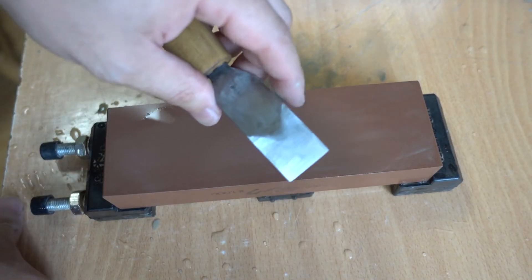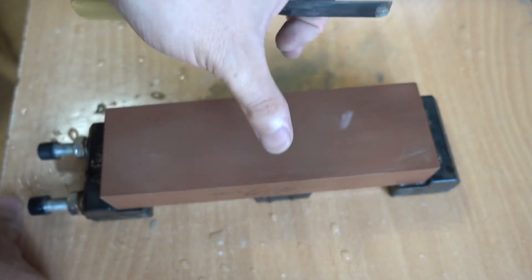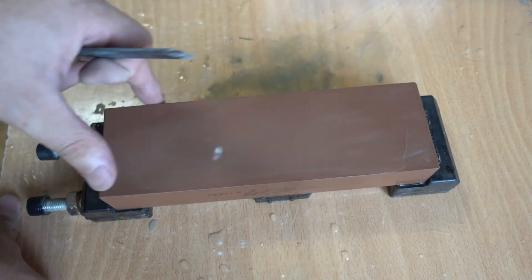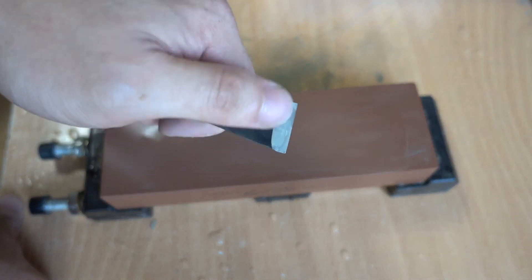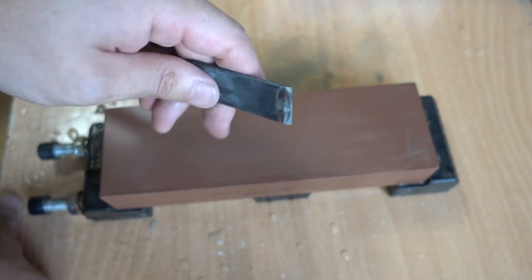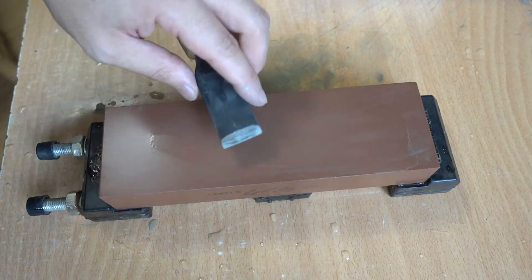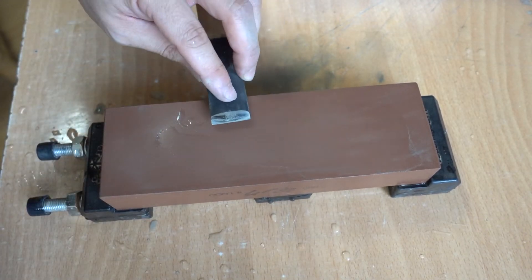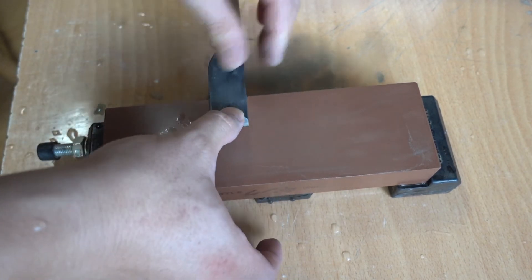With the 220 grit I made a flat surface. Now I'm going to sharpen on the 1000 grit sharpening stone — again, you need a flat sharpening stone before you sharpen this. I haven't touched the bevel side yet. I'm going to sharpen the back side first and then this side. Place your knife like this, then place your two fingers or sharpen with a thumb like this.